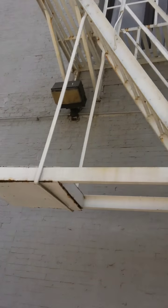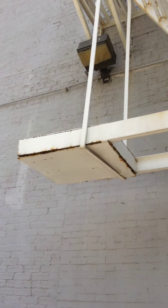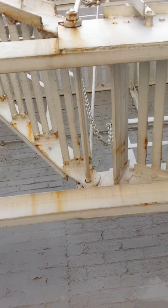So just on this box alone, I can write a structural violation, and the fire escape inspector or the structural engineer will identify all these. But these rusty tears are an indication that there's rusting going on in all these clips and that the fire escape has been just painted over and over.